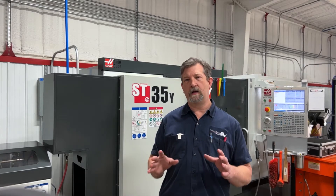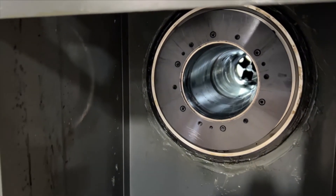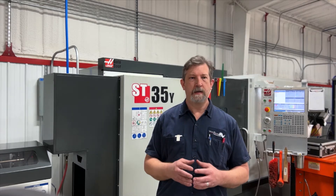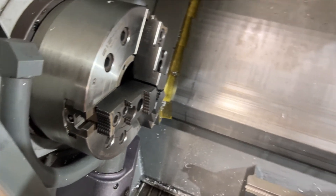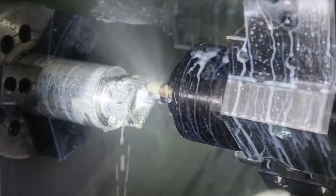I love the large through bore on this machine. It has allowed me to do jobs I would not have been able to do with a smaller bore. There is a trade-off though — I can turn something big, but I really struggle to turn something like a quarter inch. I try not to turn anything smaller than about half an inch if at all possible, but that's the give and take of the situation.